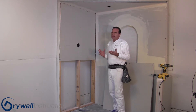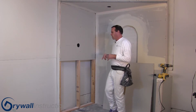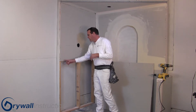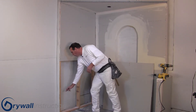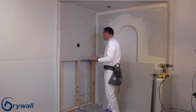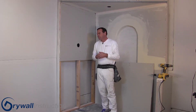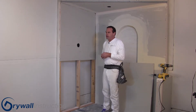If you are to use it, there's not a downside to it — there's not a problem with it, it's just an extra step. When they use the adhesive, they'll use a caulk gun and liquid nails and put a bead of glue all the way down on each of the studs. Then they'll put their sheetrock on and nail it or screw it. It's not a bad idea, it's just not necessary in most cases.